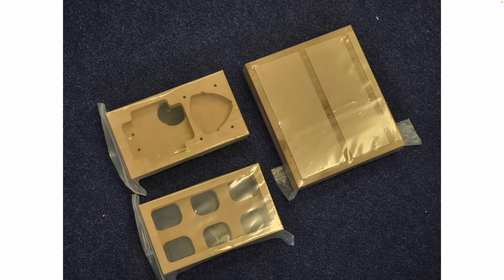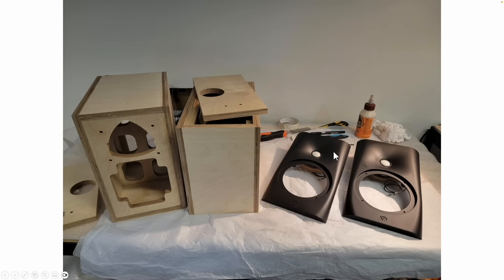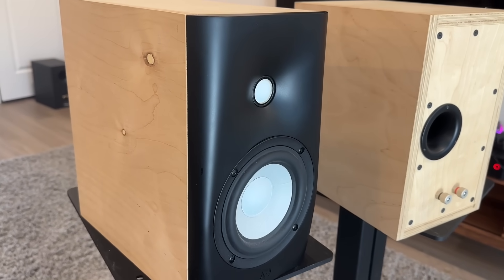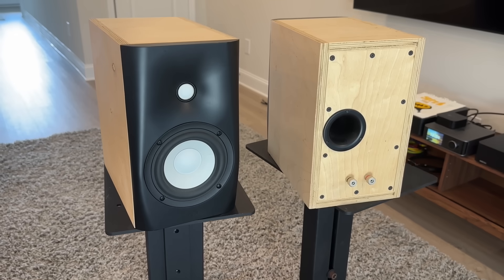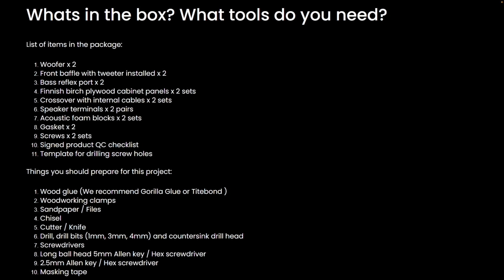This does come in kit form, and the manufacturer sent me some kit build pictures which I'm showing you here: a picture of the crossover, the flat-pack kit, the assembly of the flat-pack, the completed kit, and the baffle. Reading off a couple of specs: this is a two-way bass reflex design featuring a one-inch ceramic-aluminum tweeter and a five-inch ceramic-aluminum cone woofer. Crossover frequency is 1,560 Hz, third-order acoustic. Sensitivity is spec'd at 84 dB, impedance is 4 ohm with a minimum of 3.2 ohm, recommended amplifier power is 40 to 250 watts, and it's about 6.8 kg each. When you buy the kit you get pretty much everything you need to build it except the tools, and Audio First has a build video I highly encourage you to check out.